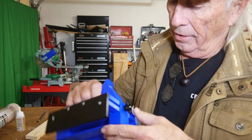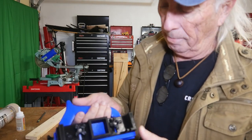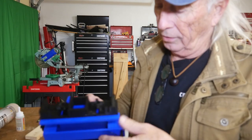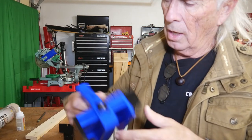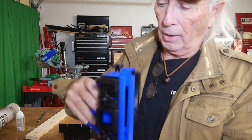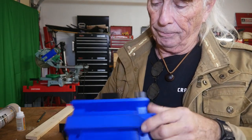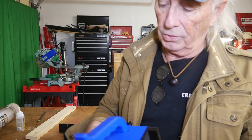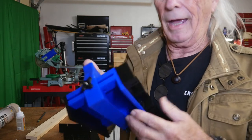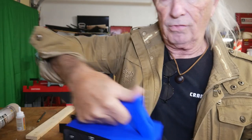The knobs — I only made one knob at first, then found out you need six. Right now I'm using three knob kits plus the one back knob. The top plate I made and didn't like the way it was set up, but without using supports it prints upright. My CR10 did a great job and knocked it out — it did scare me that it was sitting upright while printing, but it turned out okay. The handle was a no-brainer: no supports, PLA, 20% infill. I actually like this handle better than the actual power gripper supplied by Micro Jig — there's a nice rounded feature I really like.